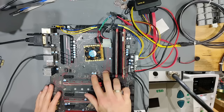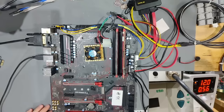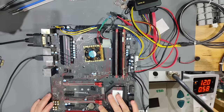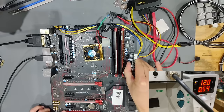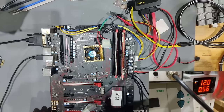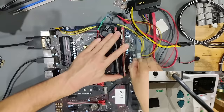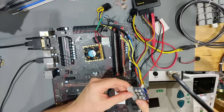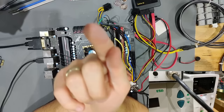We need to find out what it actually is. Turning it on — the power consumption is high. Let's see if this reacts to the power button at all — and it does not. That was to be expected. The SuperIO is not getting hot, and the 3VSB is also not going hot. That's the 3VSB MOSFET. My tester gets warm — then very hot. The 5VSB on my tester got very, very hot, and you can actually kill your tester that way. One of the regulators got burning hot and I actually burned my finger.